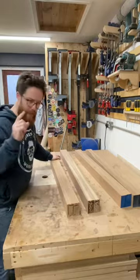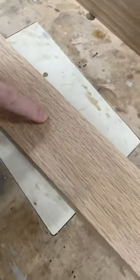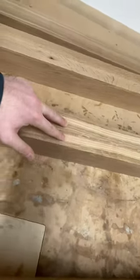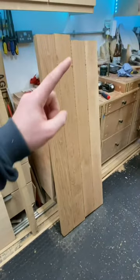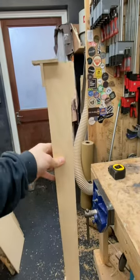Okay so these are all done. Let me take you off the tripod and I'll show you how it all looks like it's blended into one. Do you see it? So there is a seam there somewhere — I think that looks pretty cool. Because the colours match and everything, and you can really see the mirrored image. Looks really nice in my opinion. What I did — I rotated these 90 degrees through the thickness planer — they're now bang on square all round. I'm going to put these to one side, get this bad boy back out again, sand it up to 80 grit, get it cut to size, then I'll be starting on making the template to cut out the shape for this. The legs won't have a taper so it'll be a lot easier.